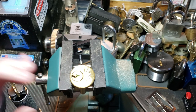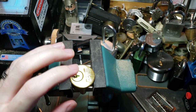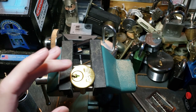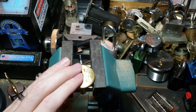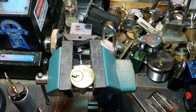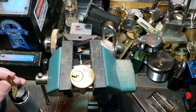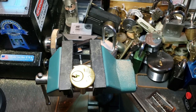The last thing to note is this lock came with sort of flat beveled pins, similar to Kwikset's factory pins. I replaced them with conical tipped lab pins, because the sharper point on them makes it a little bit easier to impression things. And with that, let's get started.